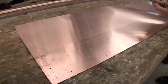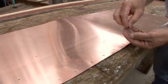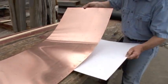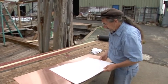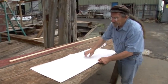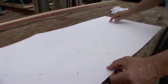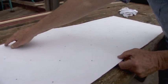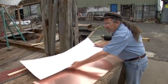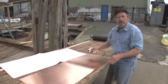The copper would be held on by these bronze ring nails — it's going to be over 20,000 of them. And the pattern for punching the copper we got from an actual copper punching machine that was at the Bath Maritime Museum. From that we developed a pattern. Generally the pattern goes that you have cross rows of nails going this way and this way, and then it's ringed around the side by nails on two-inch centers. When that goes on the boat, the next sheet will overlap this other edge, and it gets lined up almost like brickwork with one piece overlapping the other.